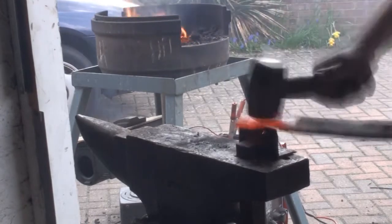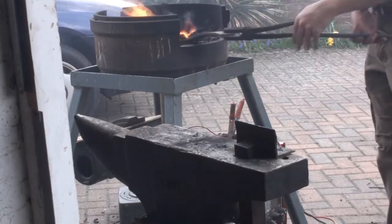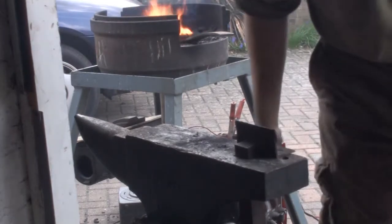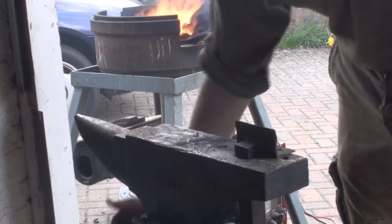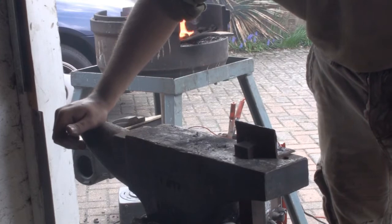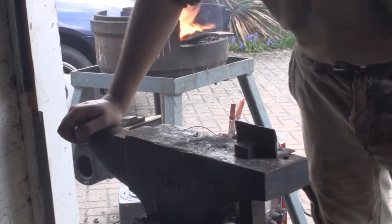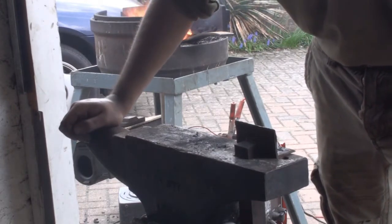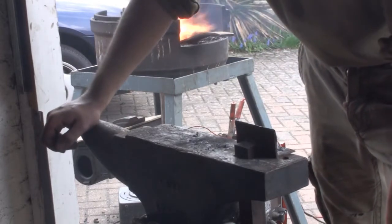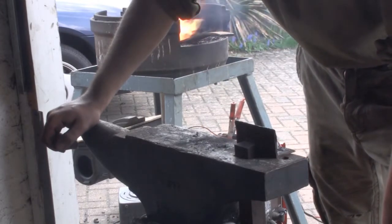There's two ways around this. The first of all is to use a leather hammer, so that even if you do go through, it's not a problem, because you're going to damage the hammer but not the tool. The second is to go most of the way through, almost completely through, so you see black, and then simply snap it off by bending it back and forth a few times. Either way works just as well. The first one is probably a little cleaner, I must admit.